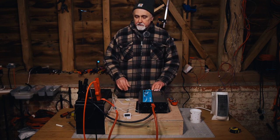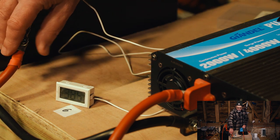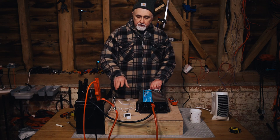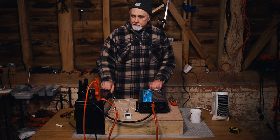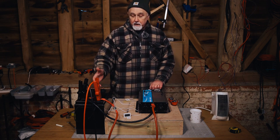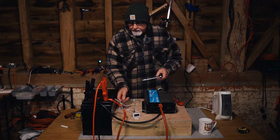Cables are all warm, as you'd expect. They've already gone down to 30 degrees because it's about five degrees centigrade ambient. Just out of curiosity, we're going to loosen this, cool it back down, and run it at four newton meters. We put a charger on in the meantime because the battery is about 20% capacity — it's only a 200 amp hour battery and we've been running several tests today.